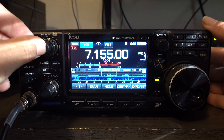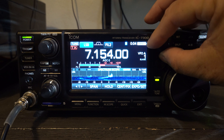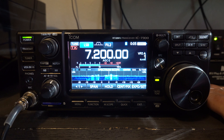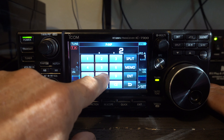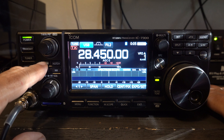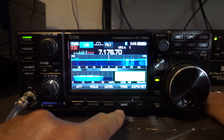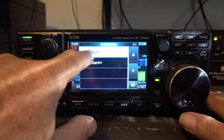Adjusting the filters is super easy and convenient — you can bring it all back to zeros. Changing filters via the touchscreen lets you do gross adjustments with the multi-knob and fine adjustments with the VFO knob. Changing bands on the 7300 is a little funky; you use the touchscreen to pick the band, set a split, or enter a frequency with the enter button which brings up a number pad. I would have liked a dedicated band button, but it works. ICOM makes heavy use of touchscreen for things like changing bands, changing frequency, and adjusting filters.